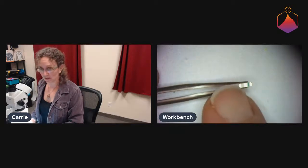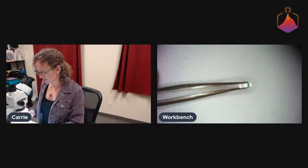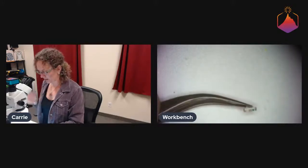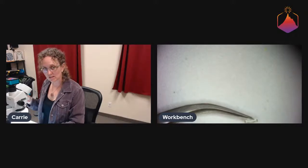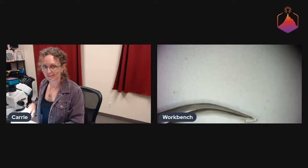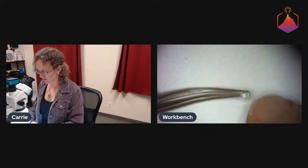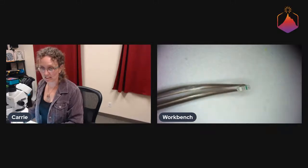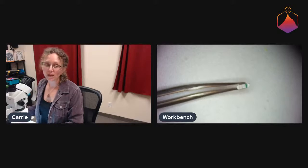So we've only done the left and the right pads there, and the entire side of that pad is one signal. RGB LEDs that are this size and side mount, the top is a separate pad from the bottom. So each of these pads on the left and right are basically two pads, one at the top and one at the bottom of the LED. So you have to make sure not to bridge both pads on the one side if you're hand soldering them.